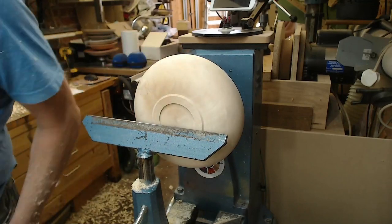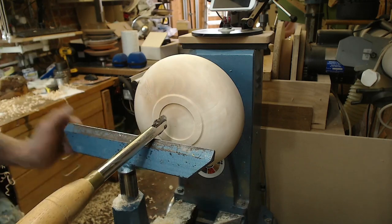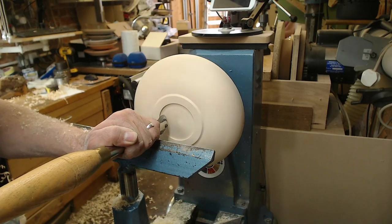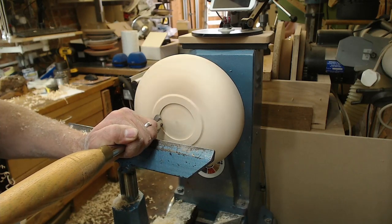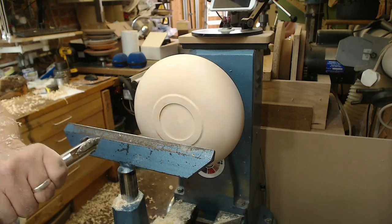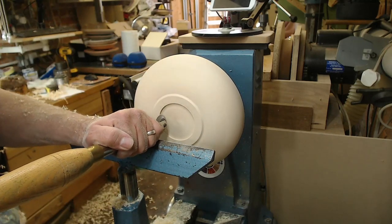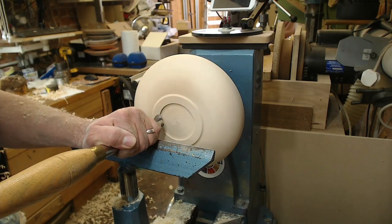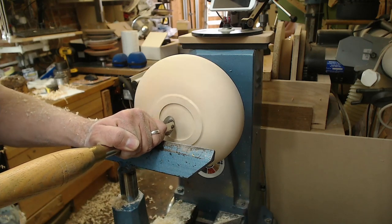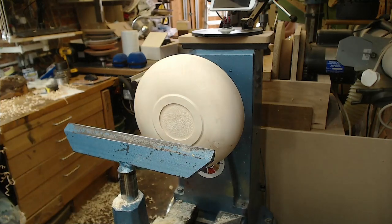I just textured all of that away — the texturing tool I'm using is the Robert Sorby texturing tool, the large one — but that comes out after I've put the dovetail angle on with my skew chisel. Just taking a millimetre or so off and running along the bottom making sure it's flat. Pull the tool rest back a bit so there's room for the wheel to spin without hitting it, then it's just a case of making several passes from the centre outwards. Take care that you don't go right to the edge and start texturing the edge of your recess — it will look very ragged and messy quickly. The other thing to bear in mind is that the foot should slant inwards so it sits nice and flat on the table, sitting on the outside edge of that foot.